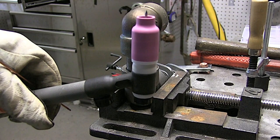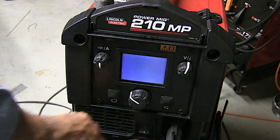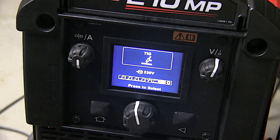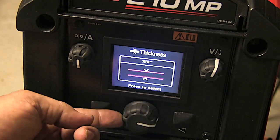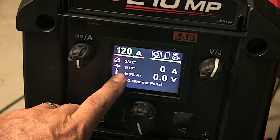I'm using an air-cooled 17-style torch with a valve on it, and I'm using a Lincoln PowerMig 210 MP — just using it almost like a scratch start, except it's lift arc, using this little fitting here. It's part number 105Z57; you can Google that and find it on Amazon, eBay, and lots of other places. You can use a foot pedal with this machine, but it doesn't come with one out of the box, and mine didn't come with a connector for one, so I'm just using the lift arc function without a pedal.